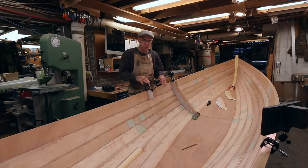However, it's a negative mold — it's a female mold — which is not great for laminating. Now in a perfect world you will have grown crooks: a limb of a tree that is grown to the shape of the boat at any particular location, and the frame would be sawn from that. So you get no joints throughout the whole side of the frame, and you would have them bilateral — one from one side and one from the other, connected at the keel. That would be the ideal, but most often not easy to achieve. So you would make up these frames out of separate sections and join them together.